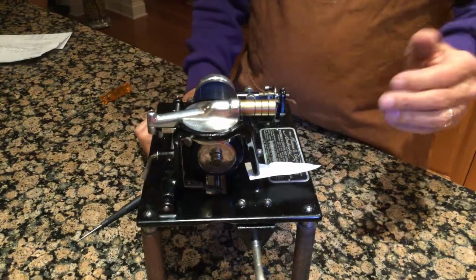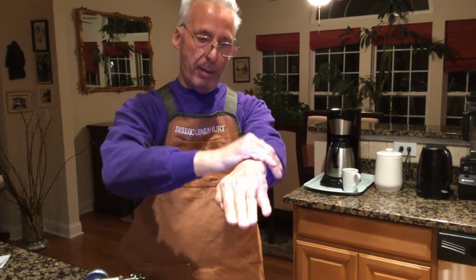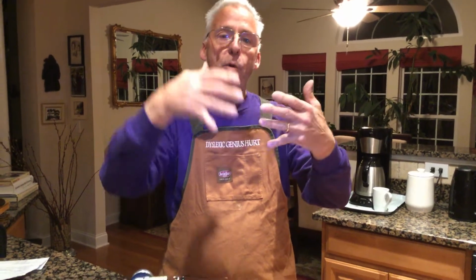And that way, once you get this done, and you have the half nuts like this, and this is your lead screw, the half nut has to come down like that, perfectly on the lead screw. You don't want it hitting this way or this way. And after you get this adjusted, you want to have it so it's just hitting the gear, the threads. Okay, you don't want the half nut driving in to your lead screw. That'll slow your machine down, it'll bog down records, your record will be playing, and do that.